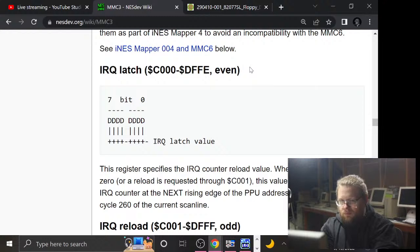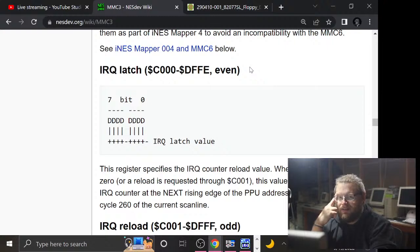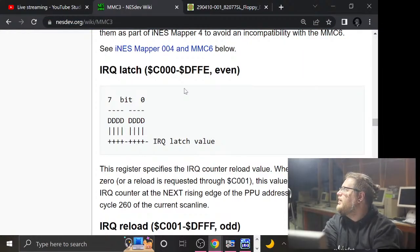I guess, you know what it might be? You know what it probably is? Yeah, it's because it's program ROM space and these are writable registers. So it's gotta be that when you write to them, it doesn't trigger all of the external stuff. So the extra address pins and the chip select and whatnot. Oh, you bastard, that's what it got. It must be, that's the only way. That's exactly, Wareworm is always like 5 minutes ahead of me, and he got to that same spot.